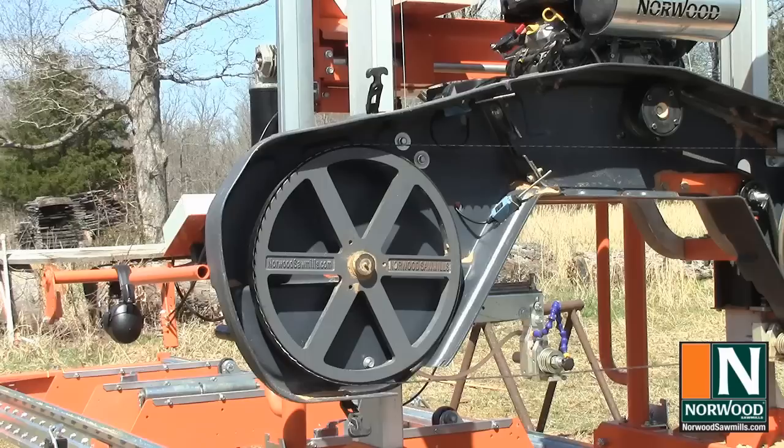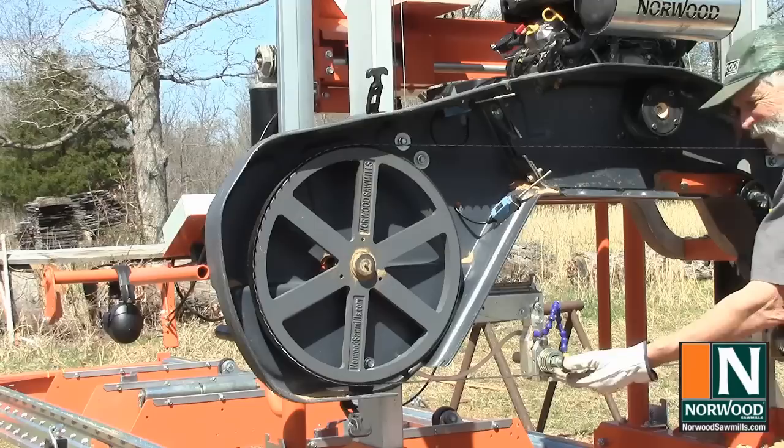If they're not, for any reason, spinning, when the blade passes under them, the blade will wear a flat spot on the roller guide, and basically you're then going to have to replace it. But everything looks good.